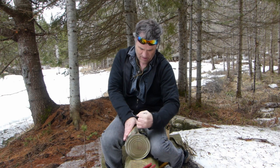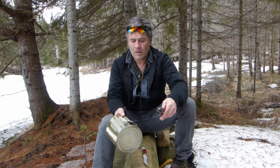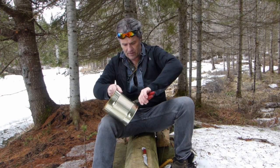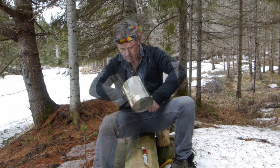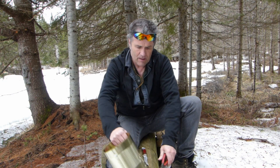It looks like I'm gonna hit my knee, I'm not. It's in the can, it's all right. Okay. Very sharp edges. Okay, now I've got that slit there. You just simply bend in the sides, okay? It takes a little finagling to get it to go. Just bend in the sides, slowly twist them in with your pliers. There, now it's rolled over, okay? So that edge cannot cut you now. That's rolled over. I'll tap down the bottom so that edge won't cut. Done. All right. Now for the other side.